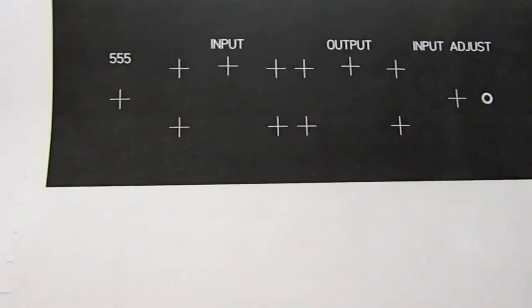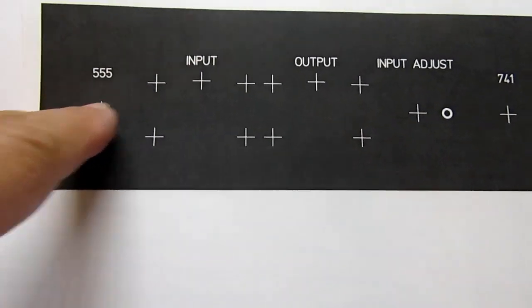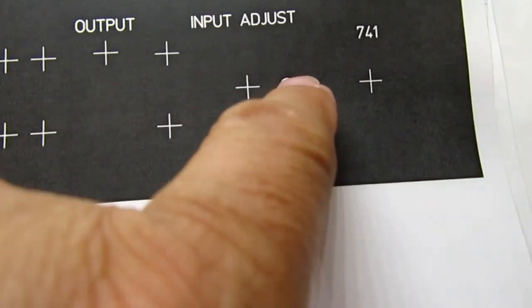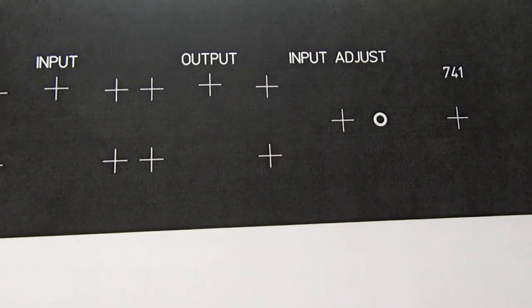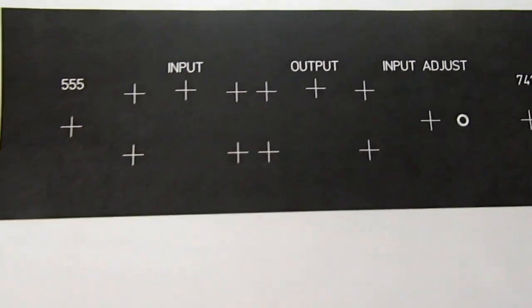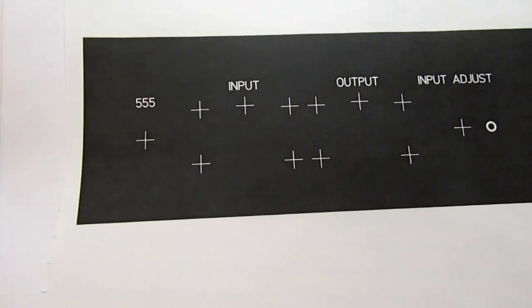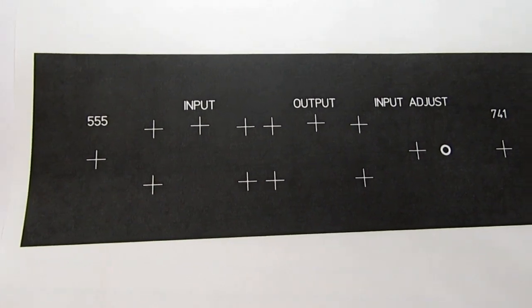Yeah, okay, it does leave the cross hatches indicating the location of holes, and that's fine for the big switch positions and the potentiometer position. I have to double check the diameter of the knob, to see if it will cover that up or not, because that circle by itself might be a good drill location. But I will have to get rid of these. I'll print a version that doesn't have the cross hatches, or the crosses rather. That'll be the actual artwork, but I'll have a version that does have these, because they'll be good locations to make pilot drill holes, that type of thing.